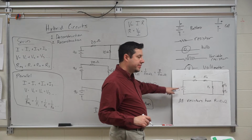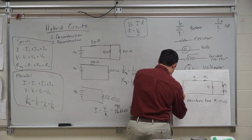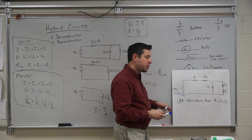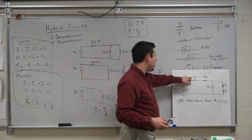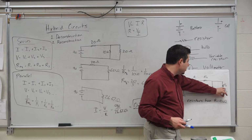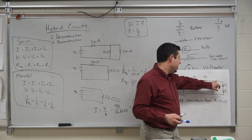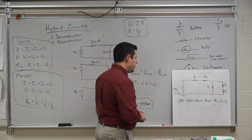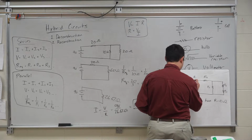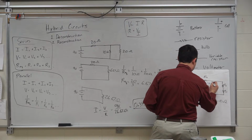And so if we look back at this original circuit that we had, we know what the current is, we simplified it, of the 9-volt battery is putting out 0.34 amps. And since this current all leaves the battery, it must all travel through R1 and R2, and then some of it goes down through R3, and some of it goes through R4 and R5. In fact, twice as much must go through R3 as R4 and R5, just because this has twice as much resistance. And we could probably figure out what that was pretty easily, but let's just start by doing it simply. 0.34 amps.